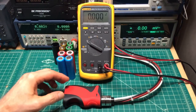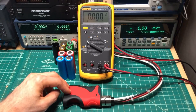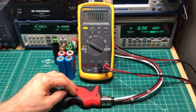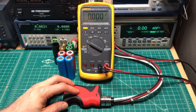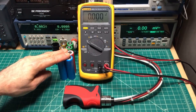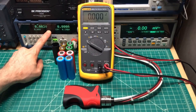Tofu lists the maximum wattage for this at about 80 watts, but some other people have done some testing and Mike is sure that it does a lot higher than that. So he sent me one to test, and what I'm going to be doing is checking how much power it can deliver using Sony VTC5A and Samsung 30T batteries.